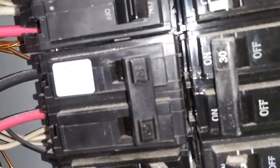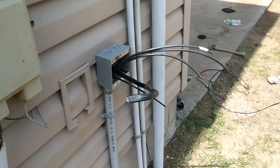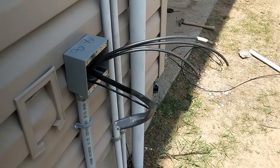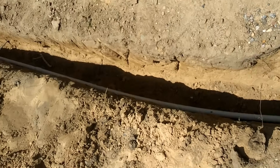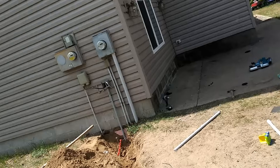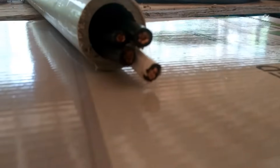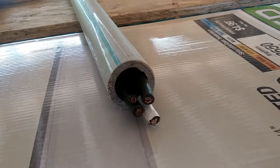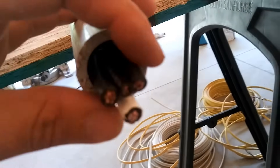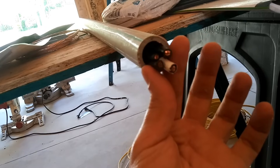The wires run down through a hole drilled outside and connect with the special cables for underground. Running outside the house, four wires go through a conduit into the garage. It takes a very long time to shove four wires through a one-inch plastic tube — I cut out a section of pipe with four wires in it, and good luck shoving that 16 feet plus up and down. So get a bigger conduit; don't go for one inch, probably go for one and a half inch.